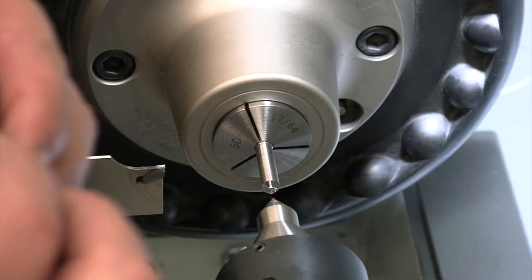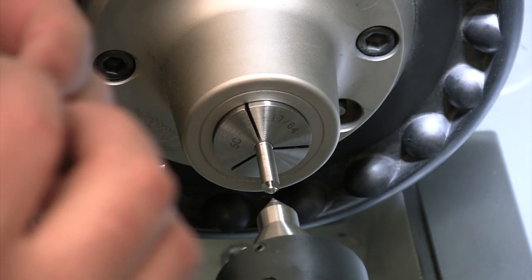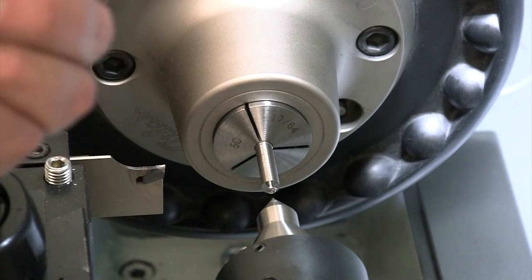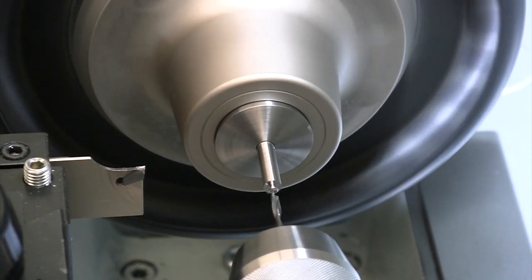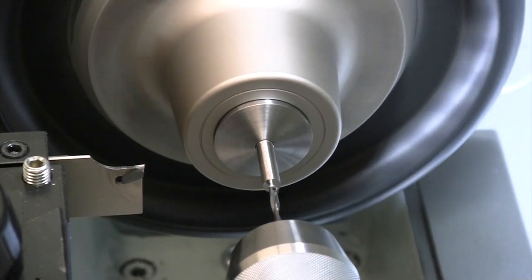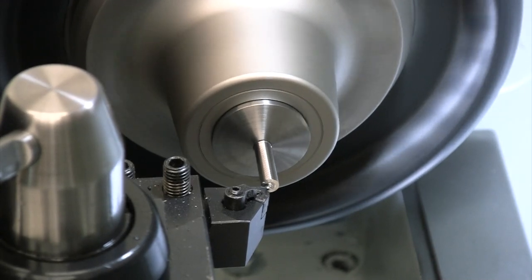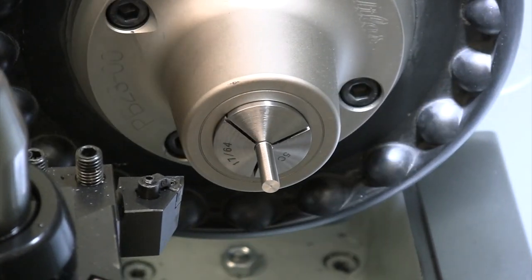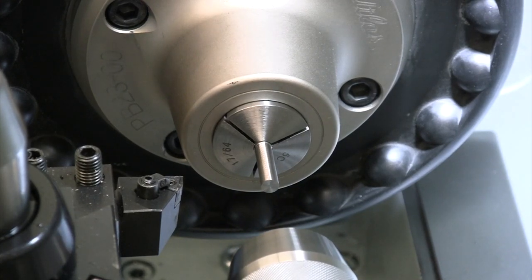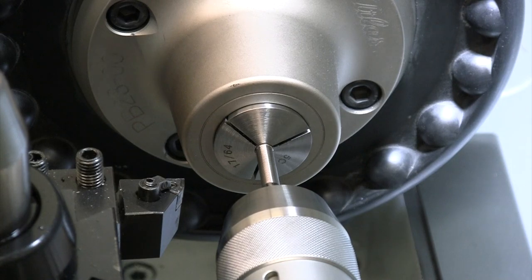My process needs a little bit of work here. That definitely parted off nice, but I need to drill a little deeper so that it goes through there a little cleaner. Tried to drill that nub off, and that was an absolute no-go. Lucky I didn't break my drill there. Went ahead and just faced it off instead. Yeah, you don't get to shortcut like you do with aluminum when you're messing with titanium. Just need to take your time and do every step.